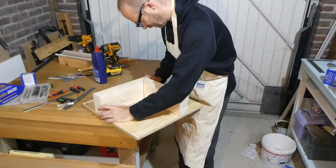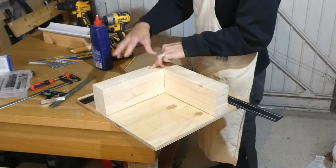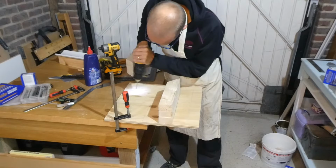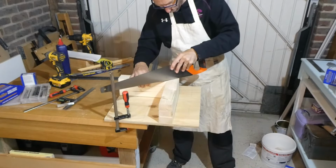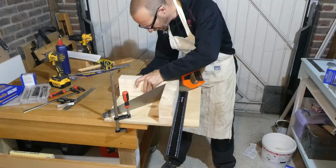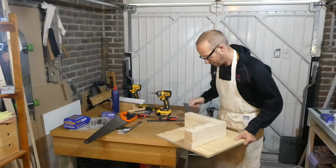There we go. What we'll do here is get the framing square on these blocks. So what I think I'll do is get one screw on this end, square it up again, check it, then screw this end. We'll drill a few holes out. Roughly get that in position. We'll put the panel saw in there, maintain that gap, framing square on, make sure that is spot on. Yep, right about there. Let's tighten that off, double check. The first stage is done.